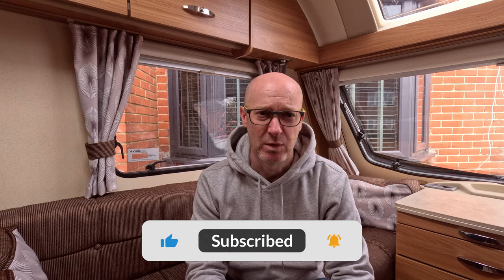So hopefully this week's video has been useful. Obviously we've covered a few points. One is around actually taking the remote control apart. The second one is replacing the batteries. Third one is testing the voltage with a multimeter. And the fourth one is cleaning the board itself and how to do that. So hopefully one of these steps would get to the stage where it eliminates the problem that you have.